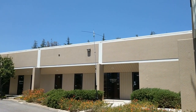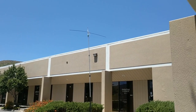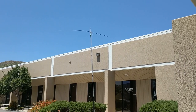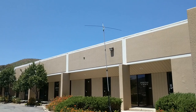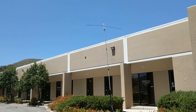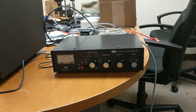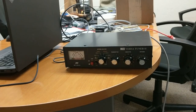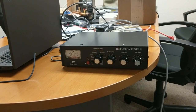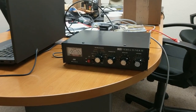Remember when I mentioned antenna? This is what we put up to calibrate and demonstrate. This is a 20-meter dipole that is a loaded dipole — there are lots of windings in it to get it short, so we can do 20 meters. It's sitting right at about 18 feet right now. We're going to use this antenna tuner to try to get the best signal possible because we've got a compromised antenna in the air and really lousy propagation right now. This is tuned for best reception.